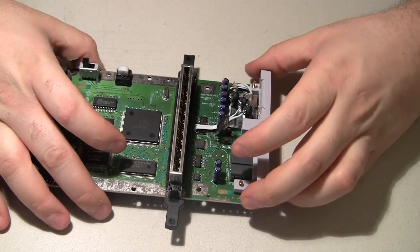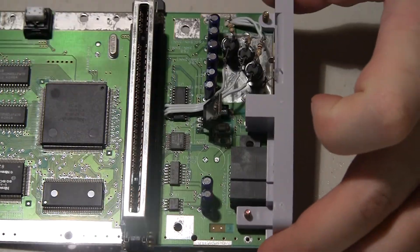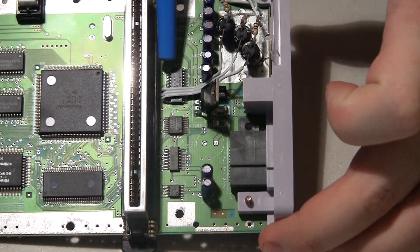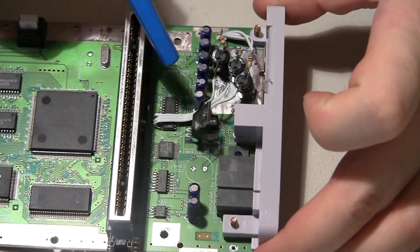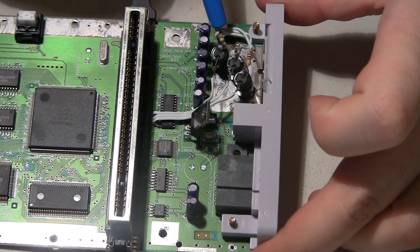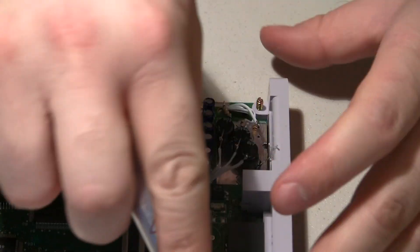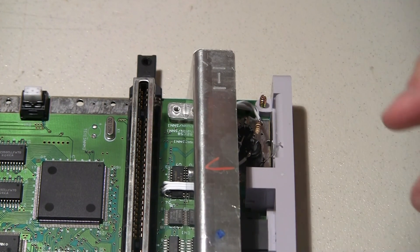So that will do it for RGB. I'll zoom in here for you. As you can see, we're pulling red, green, and blue from the sRGB chip — pin 20 is red, 22 is green, and 24 is blue — feeding into the positive side of the 220s, and each of them has a 100 ohm resistor on the negative side, and then off to the multi-out connector. I switched to 100 ohms after reading a little bit; everybody is saying that 100 ohms gives the better picture. So I'm going to put this all back together and test it out.